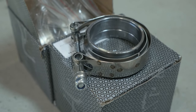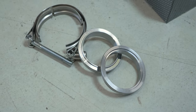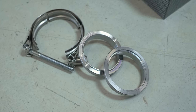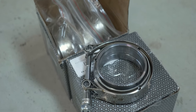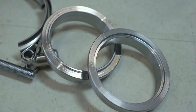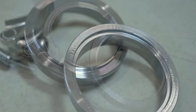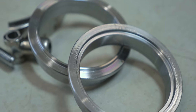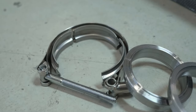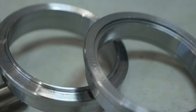V-band clamps are machined halves that go together with interlocks, so when you put them together they should not shear apart, making them easier to line up. They can also be pivoted on their axis, which helps when you're trying to get a muffler oriented properly or a pipe angled the way it needs to be. They also don't seize together like other designs because of their shear mounting face. The particular ones I picked up have mild steel machined halves — you'll mostly find these in stainless steel for significantly more money. The clamp that goes around them has a V-design to squeeze them together as you tighten it, and the clamp itself is stainless steel construction.